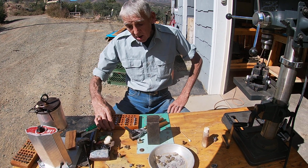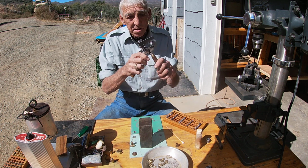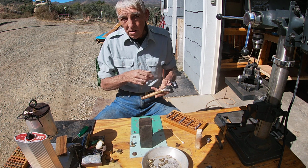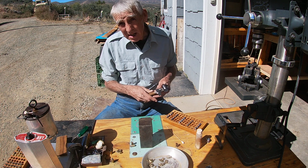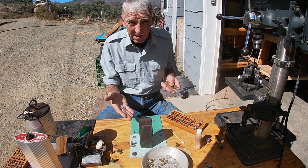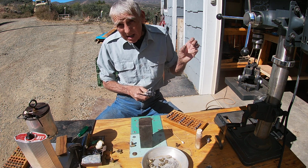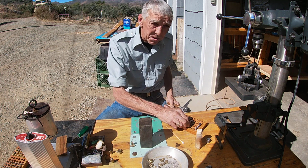And tomorrow we'll show you some different ways that you can use this little mold to make 5 different types of bullets, and different weights also. We'll run from 5/8 of an ounce, which is 273 grains, down to 1/2 an ounce, which is 218.75 grains. And 1/2 an ounce is what our target was, because all the loadings, there's so many of them for 1/2 an ounce. And that's why we've chosen 1/2 ounce.